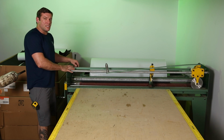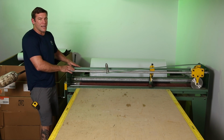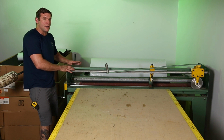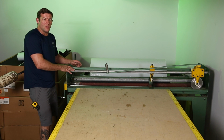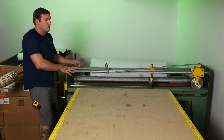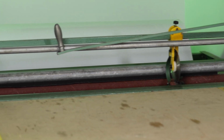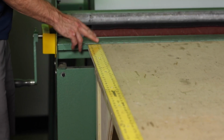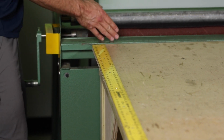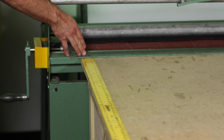I've got a 10-knocker TK5 here that we've heavily modified. This table here is actually made for regular fiberglass duct liner. We wanted to find a way to increase production a little bit. We got sick of having to mark everything out. This has worked great for us. We built this table here and we embedded these rulers. We routed out the edges and embedded them. We also cut the rulers to where the dimension starts is the actual cut. It equates to where it's going to actually be cut.